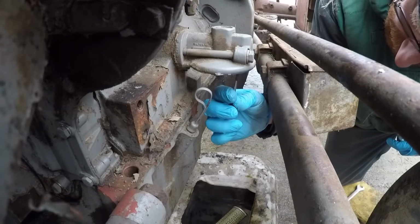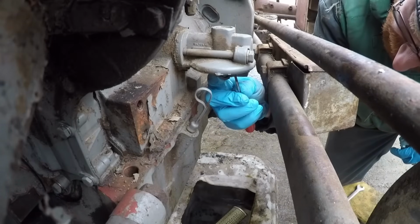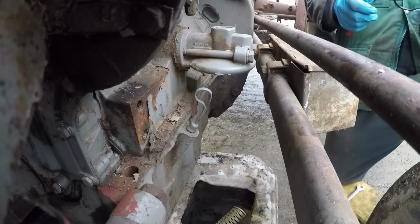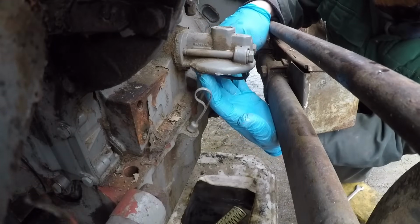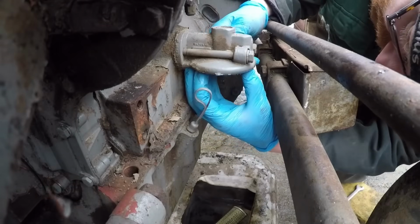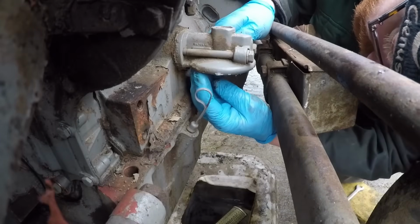So once the bowl has gone out of the way, we need to change the O-ring around the top. Pull it out with a screwdriver somehow. There it is. And then put in the new one, hoping that it will stay there on its own, without being twisted. Because that will guarantee a leak then.